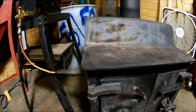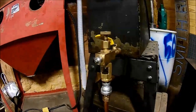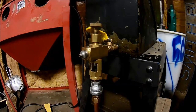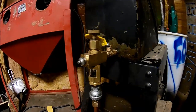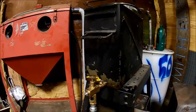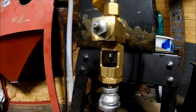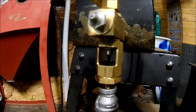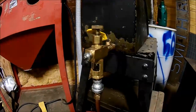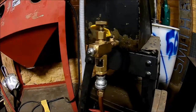I used little plates that were being thrown away. This needle valve in front of a ball valve is basically connected to an old ammo can, so this adjustment here allows me to adjust the flow — you can see where the flow is right there. These little valves don't come cheap, so I was thankful to be able to scrounge this rather than having to pay for it.